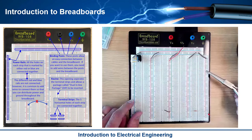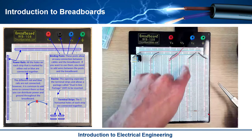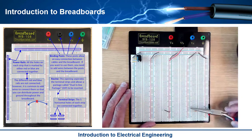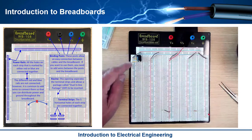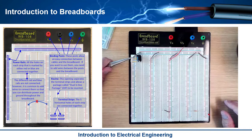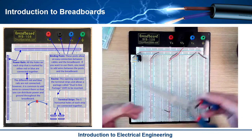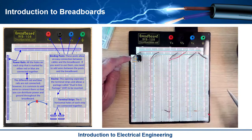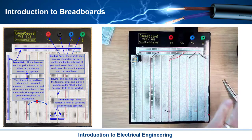The red is not connected to other reds unless you do that. So if this breadboard was empty, this red strip right here is not connected to this red strip, not connected to this red strip, not connected to this red strip. Same thing with the blue — this blue is not connected to this blue, not connected to this blue, et cetera. One of the first things you do with breadboards usually is you wire all the reds together. You can see I did that by putting a little jumper wire connecting the highest hole on this vertical strip up to here. That connected all these holes on this red power rail to all the holes on this power rail, and then I jumpered them down to the reds on the other side. So now every red on this breadboard is connected together, meaning I can bring in a voltage and distribute it across the entire board.